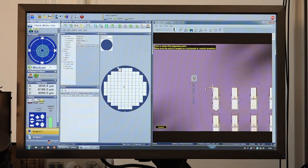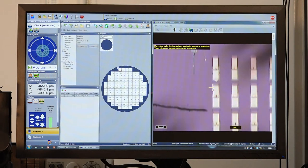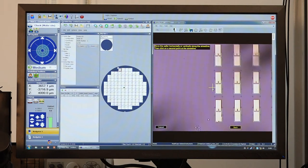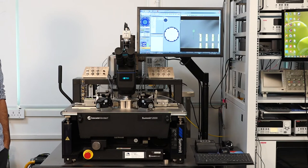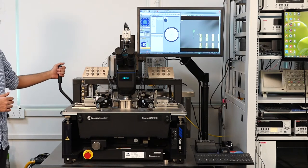We select the first point on a well-defined structure, then go along the same line and select another point on what we know is present on the same line. The die is now in focus; however, the probe tips are at a significant distance from the die. In order to get the die closer to the probe tips, we will have to move the lever down.